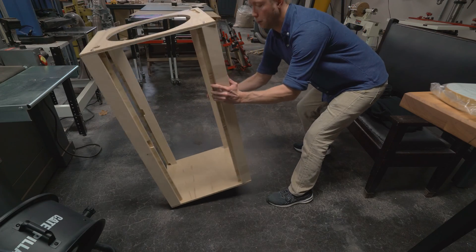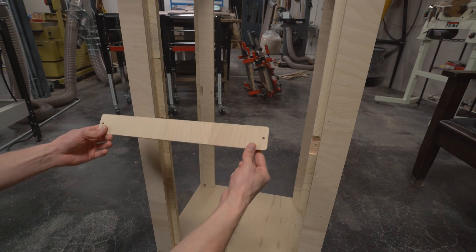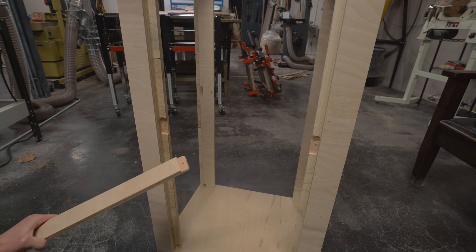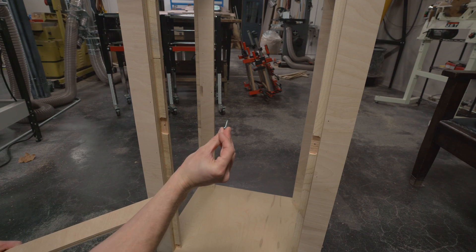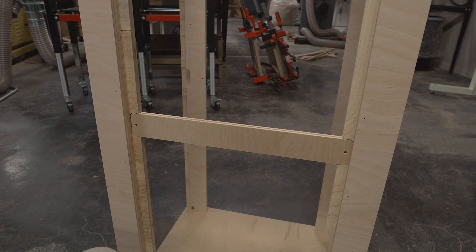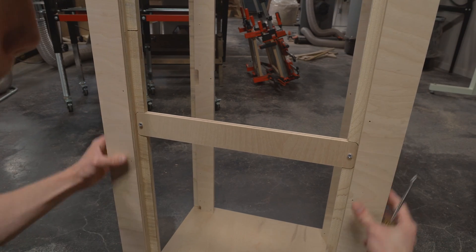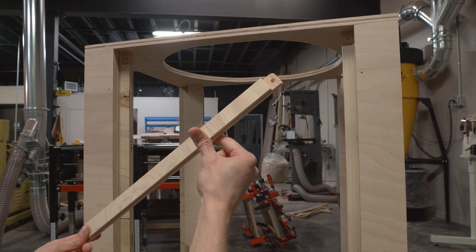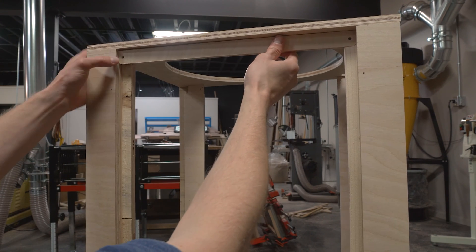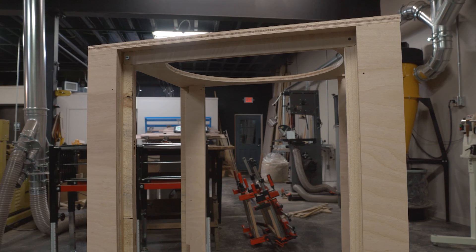Set the unit upright for the next steps. Now we install the first horizontal brace, starting with the 2-inch thick one with the rounded corners. We use a 3-quarter inch screw for this side of the device. Using a Phillips screwdriver, insert the screw. Do not fully tighten the screws on the horizontal braces until all 12 of them have been installed. Now for the top side, align the rounded corner of the brace with the rounded corner on the leg. The notched edge of the part faces inward. You may need to loosen these screws on the top side of the unit if the brace does not drop in smoothly.